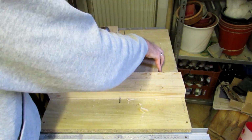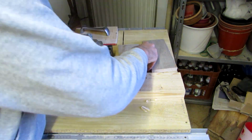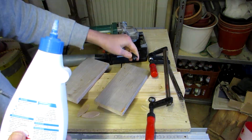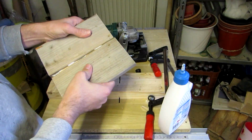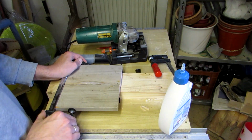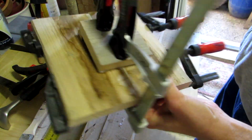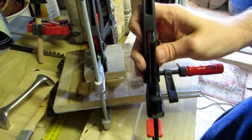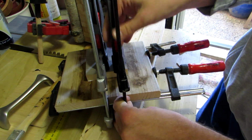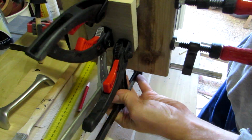For the actual roof, I take 2 pieces of the board and use my biscuit jointer to align them, and I glue them up using waterproof glue, which I used for all the other glue ups already too. To actually fit the roof onto the house, I'm gluing the top piece to the roof piece with a piece of scrap cut from the same board as a spacer to give it an angle.